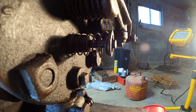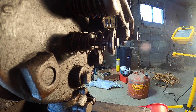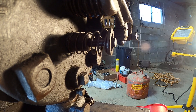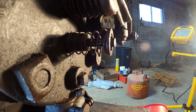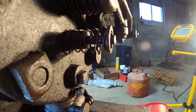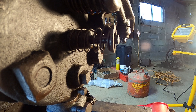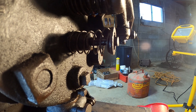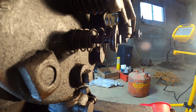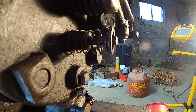So now we know the term 'hit and miss.' The engine's not firing — but how is it not sucking fuel? Well, as you can see here, this is the intake valve. I mentioned earlier it's an atmospheric valve — there's no rocker arm on it. The vacuum of the engine will pull that valve open and suck your air-fuel mixture into the cylinder. During the hit and miss 'miss' portion, the engine is sucking air in and out of the exhaust valve, so there's no vacuum to suck fuel up. Watch this exhaust valve when it comes up on the intake stroke — when the exhaust valve closes, watch this intake valve open. You can see it sucking that intake valve open, and fuel and air come up through the carburetor into the cylinder on the intake stroke.